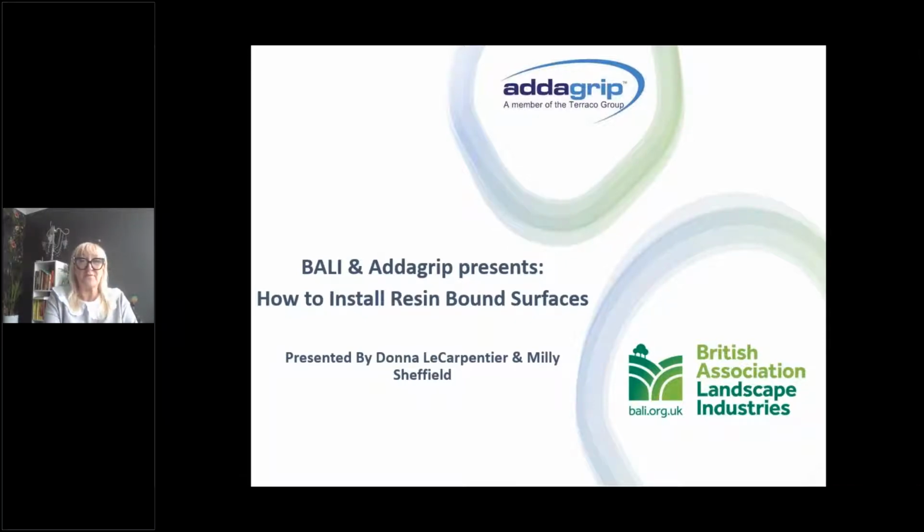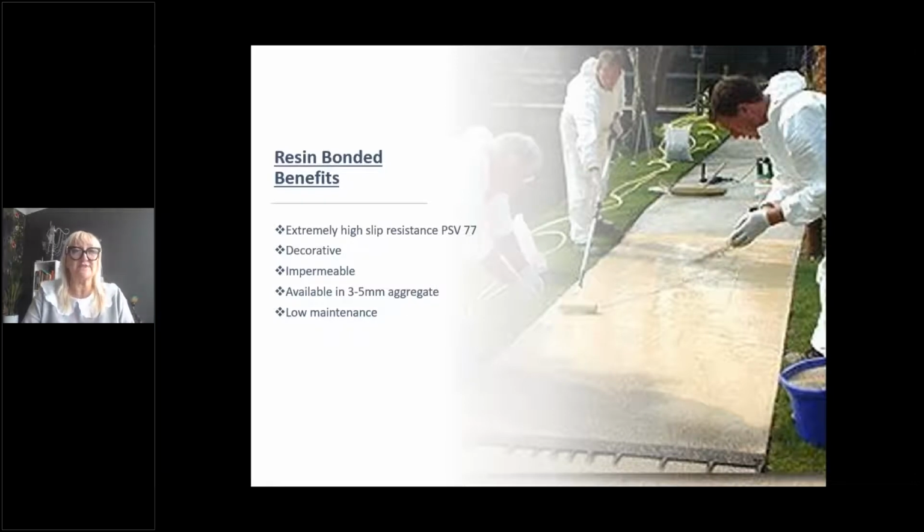So I'll start with the first slide, which is actually about resin bonded, because there is still an awful lot of confusion about what is bonded and what is resin bound surfacing. Resin bonded, as you can see from the photograph here on the slide, is a resin which is coated onto your surface, which has been prepared, and then an aggregate is cast into the surface. It's a very thin surface, only about 3 to 5 millimeters, basically the size of the aggregate which is cast into the resin.